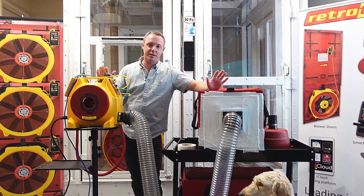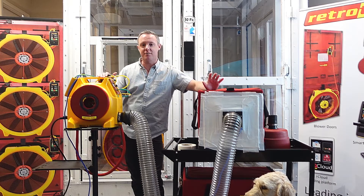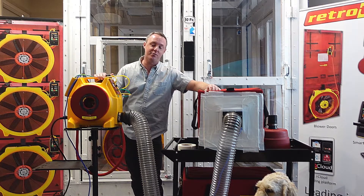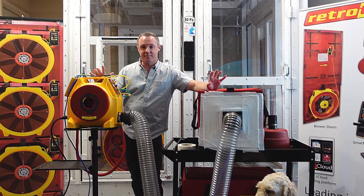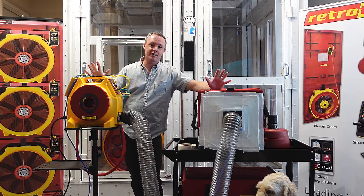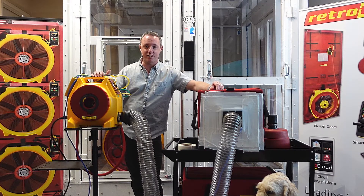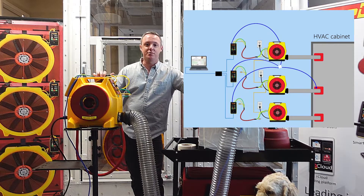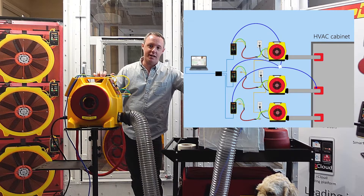To compare to other models: at 8 inches of water, this fan can generate 295 CFM of flow. And if you're testing large air handler cabinets where one fan isn't quite enough, you can daisy chain multiple fans together to get up to the pressure you need, and still read the flow just as accurately as if it were one fan.